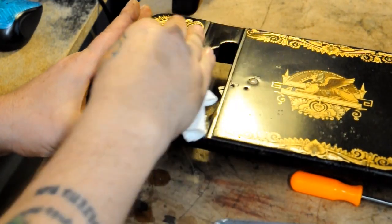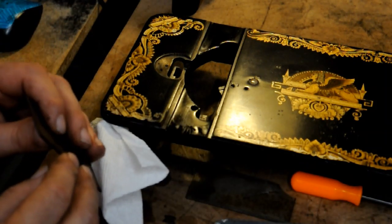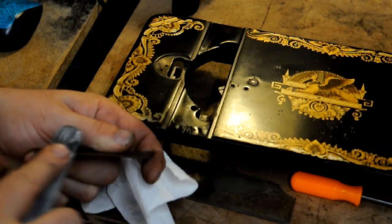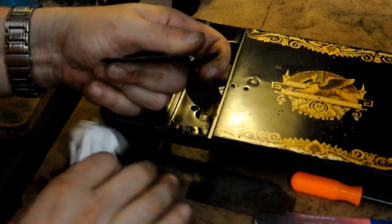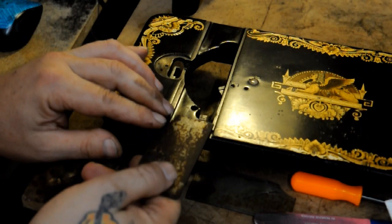Now, I haven't worked on any of the metal pieces yet, but to give you an example, let me find the correct slide piece. This is the front, oh God, this is disgusting. But these front slides are also tapered, and they're tapered, this is the top of it, that way. Yeah, they're both tapered in the same direction. Once again, you can clean those surfaces. You can feel when it's riding correctly on it, and you can clean these off with a nail file. But we're gonna take a little bit more drastic action on this anyway. We're gonna soak this stuff in Evapo-Rust to get a lot of the surface rust off of it. But I just wanted to show you that, so that'll allow it to get in there, slide it.